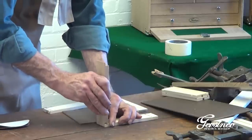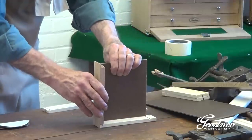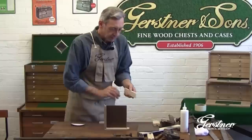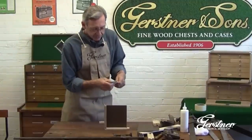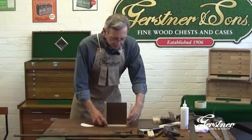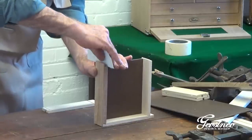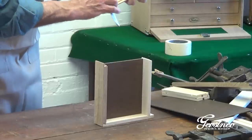Try this out. Line up these grooves — that's where the drawer bottom is going to go. Line that up and try to fit the whole thing together without glue. You'll find that it doesn't go together very easily; these are very snug fits. The real secret here is to take a bit of sandpaper and to clean off the edges. Just take some of the fuzz that comes from the saw, clean the edges, and it will fit right into the slot. Clean out the slot — when you look at it, you can see the saw marks right inside there, and that's what's going to hang up.